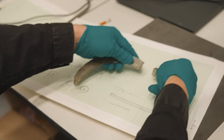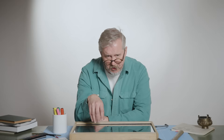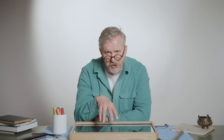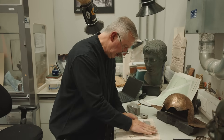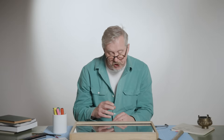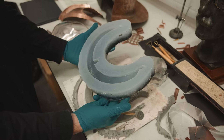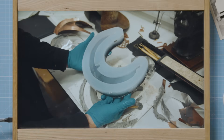When you work with metal you get a feel of how things are made. This hasn't been raised — it's actually been cast in brass, because it's simply an awful lot of work to hammer out and cut such a strong metal as brass. It's far easier to make a prototype and then cast it in molten metal — it saves a lot of time. So here I'm warming up some modelling clay to make the prototype which will then be sent to a foundry. The original makers would have used wax to recreate their prototype. Here's the silicon mould — once the silicon is set, the mould can be peeled away from the model and you've got the negative shape from the positive model, complete with a little metal sprue which I believe was part of the original design.